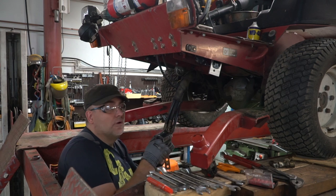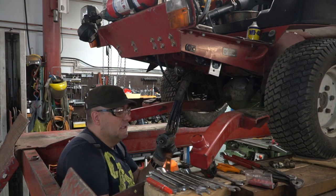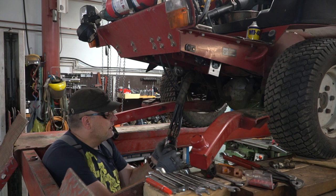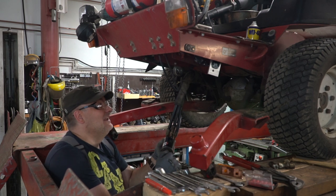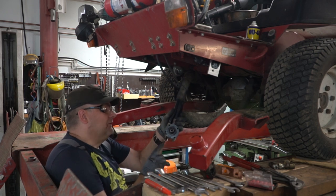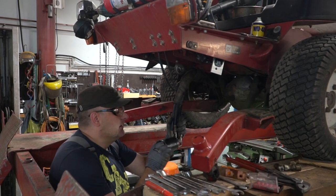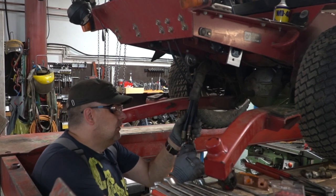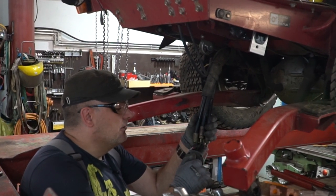routes had a flow outside, so it started to smell out that maybe there is some internal fault with this, with the pressure relief or with the priority valve. Yeah, and the EF port, I guess it's a sign for excess flow. At least in Danfoss other priority valves, it's the meaning of that port marking. So the excess flow port should provide the pressure for the auxiliary hydraulics.